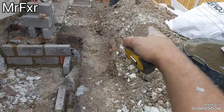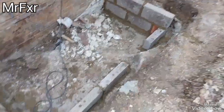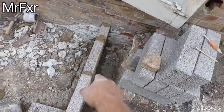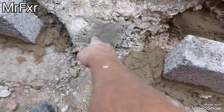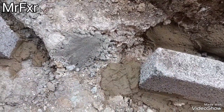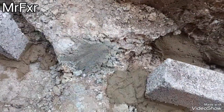And then most of this soil, I hope most, will go in there in the middle, level it all out so the slab can sit on it. And around the edges. That will take a fair bit around there. I'll have to bridge over this little stump. I capped off with the concrete this branch, the pipe where we had the kitchen gully, and I'll have to bridge over that so I don't put any load on any section of that branch.